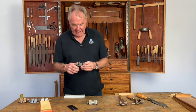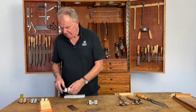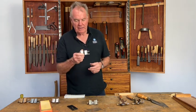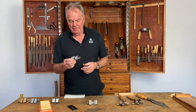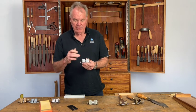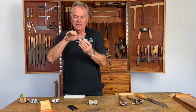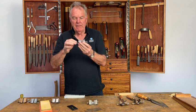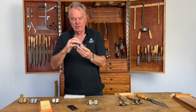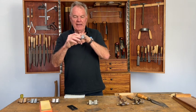That nice tool was copied in Taiwan and there are plenty of these around. I've used them for years, or tried to. We would often file the faces down a bit because they would belly or hump when you tightened up a plane blade. We'd also file the chisel jaw to make it a better shape.